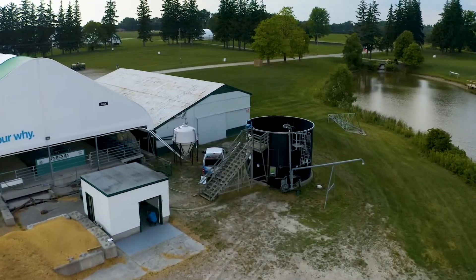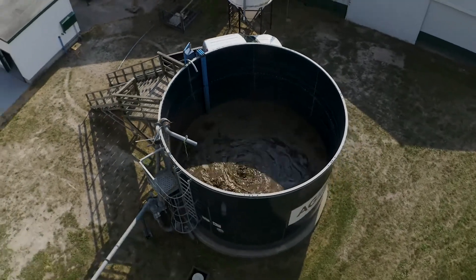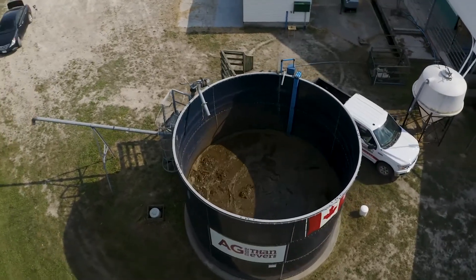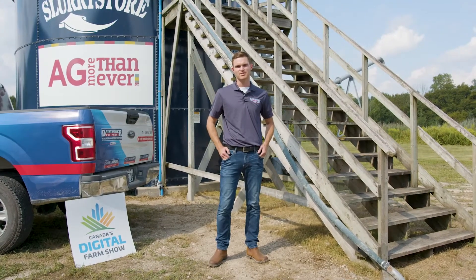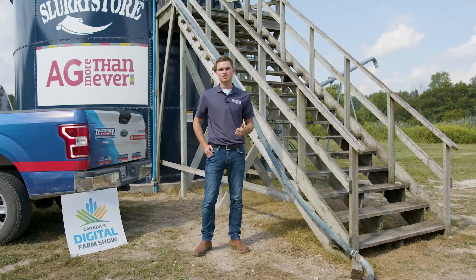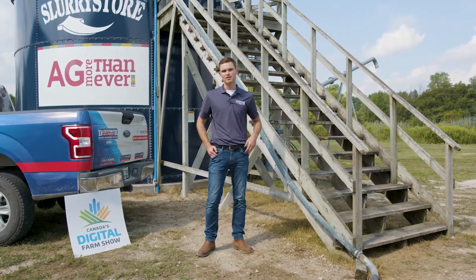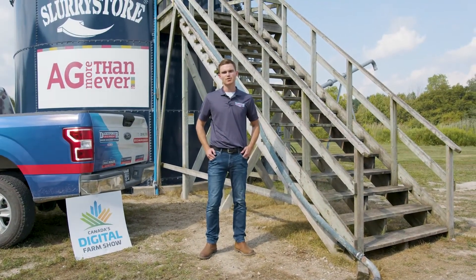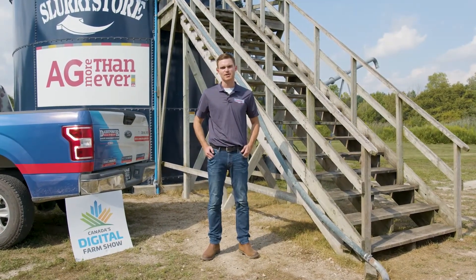The smart manure aeration system is an aeration system that we install on the tank floor. We provide air via a seven and a half horsepower, 5.5 kilowatt motor, and we provide air to the manure tank to keep the manure in a liquid state year-round, ready to pump whenever you're ready to take it. We get an odor reduction, a reduction in methane, ammonia, and hydrogen sulfide gases, and we get a dramatic increase in nitrogen content — about a 70% increase in ammonia nitrogen levels, and a 48% increase in the total nitrogen levels available in your manure.